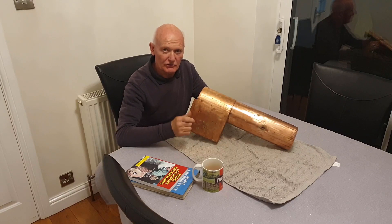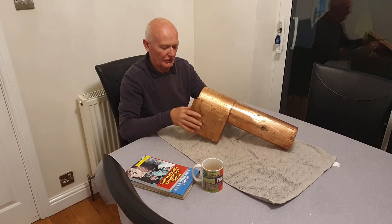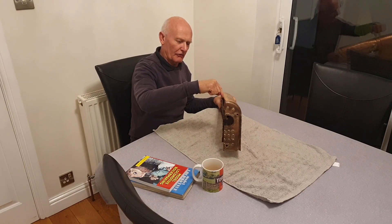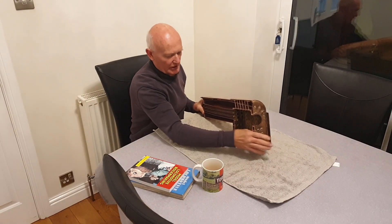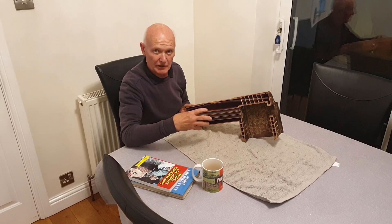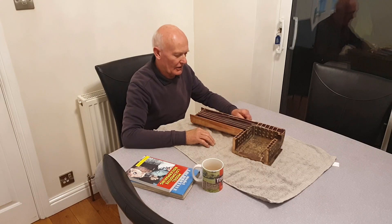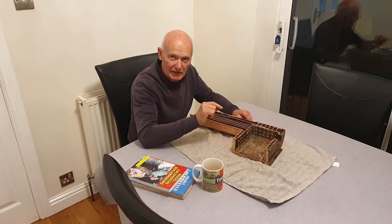So here's the boiler I'm wanting to have a quick look at. If I turn the boiler around, we can see that this is a section boiler - it's been sawn directly down the length of the whole boiler and taken away into two pieces. So on this one we can actually see the inside of the boiler as we would see it on a drawing, but now in its actual construction. Let's have a closer look at the fit of these pieces and perhaps where the silver solder might get along the joints.